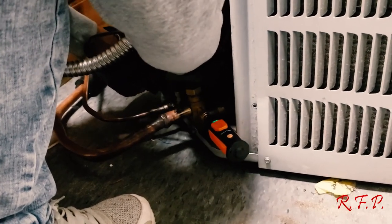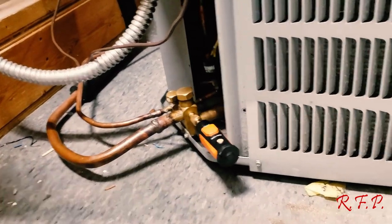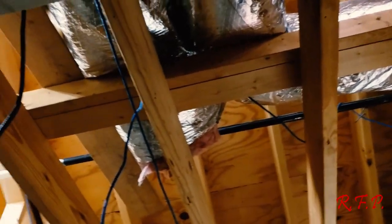Start looking for a crushed duct under the floor. Collapsed flex. Dirty filter. Well, you run across one occasionally that's got two filters in it and somebody didn't know there was one under the floor and they changed the one in the house and didn't change the one under the floor. Absolutely, you'll run into that. You'll run into a filter under the floor every once in a while.